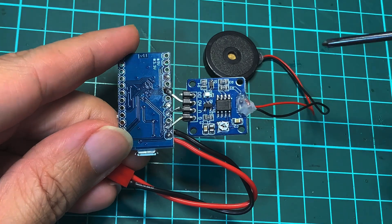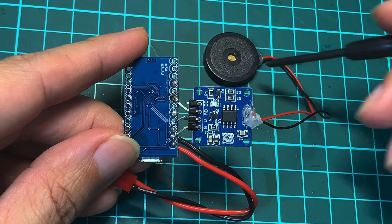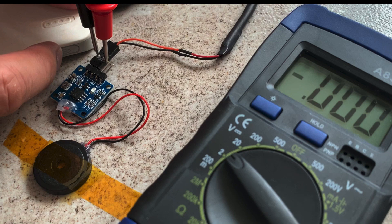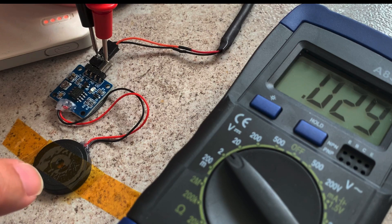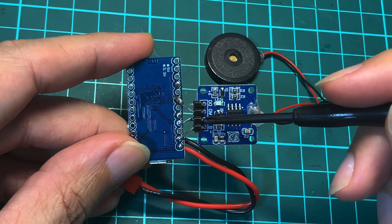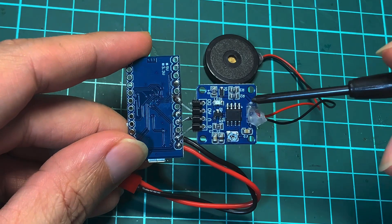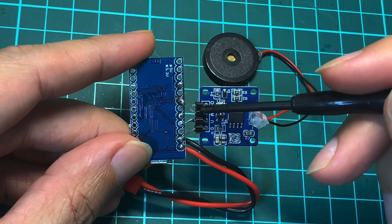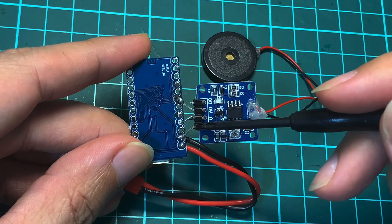This is what I came up with so far for the Nerf target board. Over here we have a piezo and a controller board which reads the reading of the piezo. There's a potentiometer here for you to set the sensitivity. Interestingly, it outputs a steady 0.29 volts and the voltage increases when there's vibration. I've connected the 5 volts input to the VCC out from the Arduino, and hooked up the analog output from this piezo controller board to the analog pin A1 on the Arduino, and lastly we have the common ground.